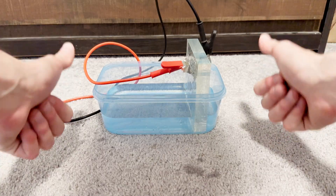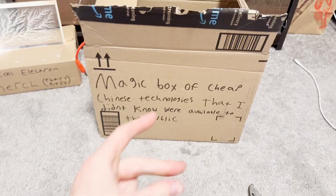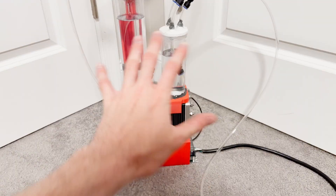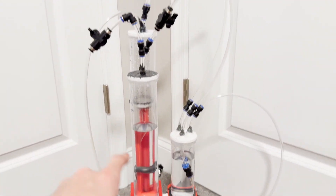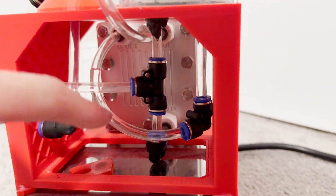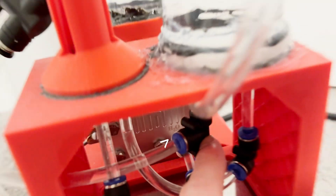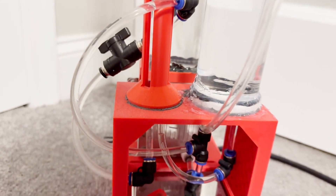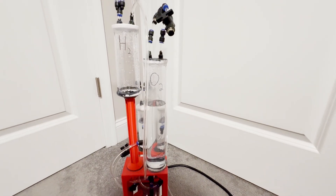So here it is — a rudimentary PEM electrolyzer. Now all we need to do is put this into the magic box of cheap Chinese technologies that I didn't know were available to the public, and out pops a functional PEM. Let's see what the power of this one kilowatt system can do. Before I show what it can do, I know some people are probably interested in how the rest of this works. Briefly put, it's literally just tubes and valves taking advantage of pressure, all sitting on top of a power supply. If we look under the bridge, you can see where the oxygen comes out, here's the path that it goes, here's where the hydrogen comes out, and you can also see where the water comes in. The water side and oxygen side are connected to the same reservoir because the anode needs the water on that side. The head pressure also prevents as much hydrogen from diffusing over, but it still can become a problem with these devices and reach the explosive limit if you run it for a long enough time.